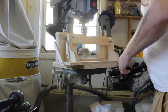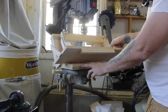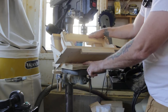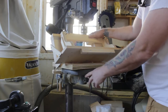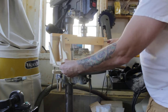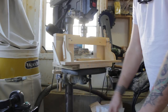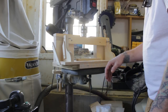You'll also notice that my particular drill press has a round table, and of course to keep your cuts square and at the right depth from left to right as you put the wood through, the jig has a guide on it that's flat. So I had to clamp a square piece of stock - made from two pieces of plywood that I glued and screwed together - so that I've got a flat 90-degree base to set this on. That way when it slides back and forth it stays square to the drill bit. If you've got a square table on your drill press, you're already set.